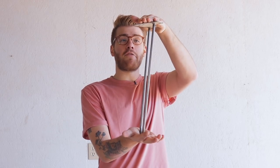The other reason I want to make my own, aside from just enjoying making things, is that these have a five degree pitch to them which is standard to hairpin legs. I think they'll look cooler if they have a little bit more of a dramatic angle — we'll be shooting for 15 degrees in this video. Buying pre-made hairpin legs is totally fine, they're affordable, they look really cool. But if you're interested in customizing and getting something a bit more unique, that's when you start building things yourself.